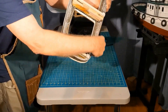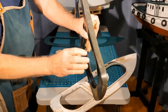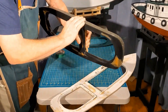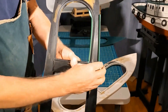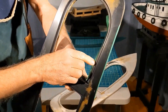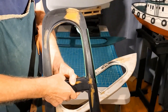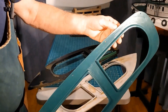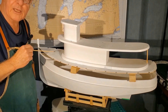I've reinforced it with long strand fiberglass body filler and put supports on it so that it doesn't lose its shape. The deck mold has some outer flange and inner flanges around the hatch openings. These flanges form a surface that I can put masking tape on to create a boundary for my layup part. After my mold has been all waxed up, I put tape along here and that forms a boundary for my first layer of gel coat, so there's no spill over the sides of the mold. This makes it a lot easier to do my layup because there's no cleanup afterwards and I get a more accurate part.